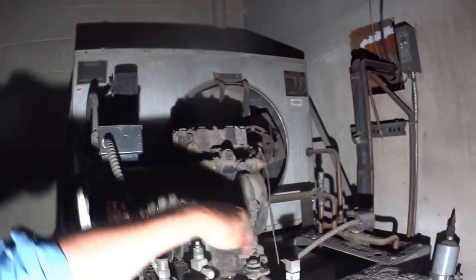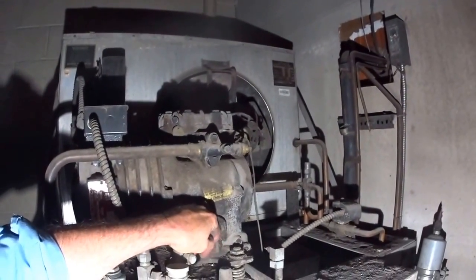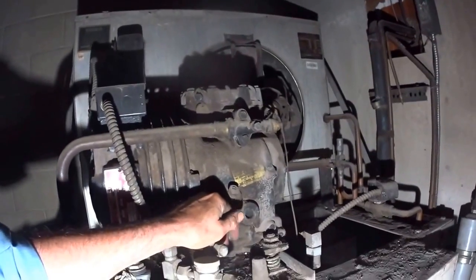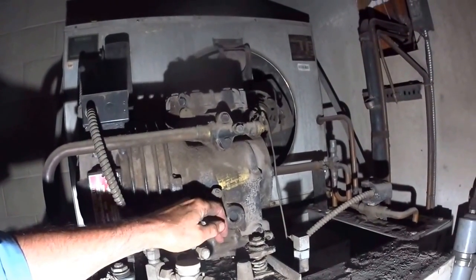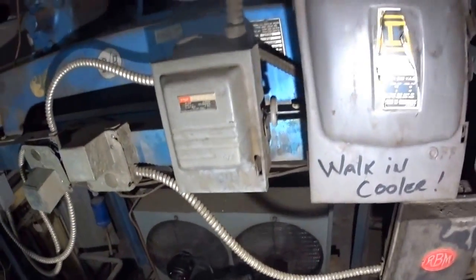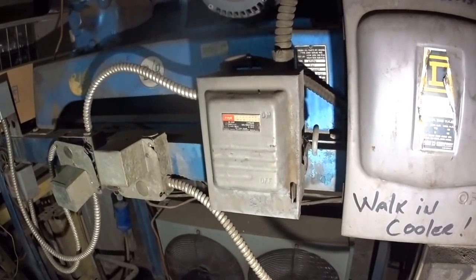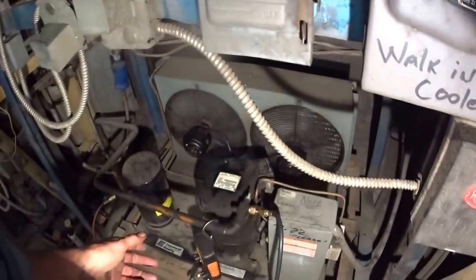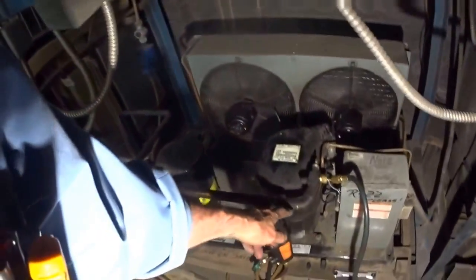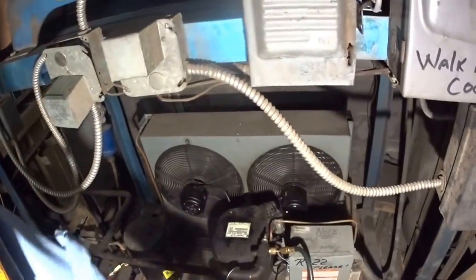What I found when rebuilding these: in the oil sump at the bottom, there'd be copper filings — it'd look like copper dust — and pieces of aluminum from the piston rods down there. But what happens is the little bits of metal that get into a hermetic compressor sit at the very bottom of the sump underneath the oil and just stay there forever until the compressor gets changed. So you don't really have to get crazy about copper filings in the line. Like I said, when you braze lines you get brazing BBs in there, and that ends up in the bottom of the compressor sump.